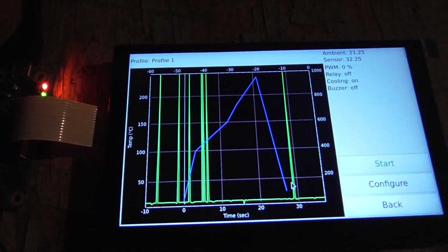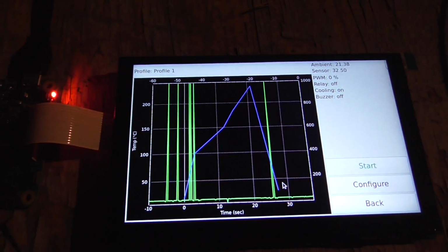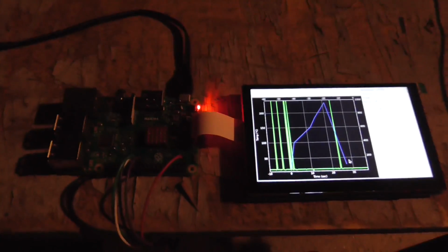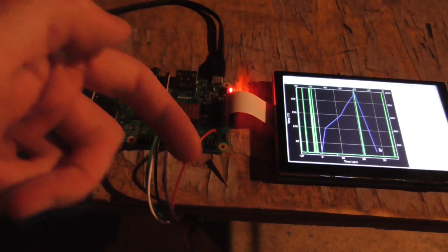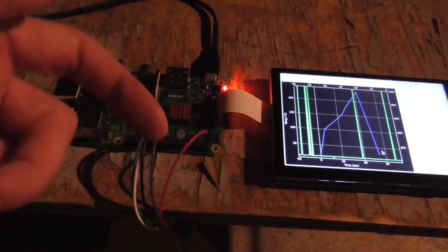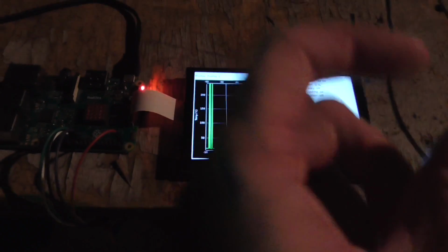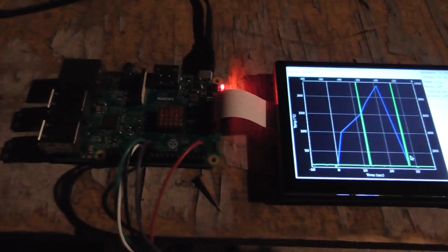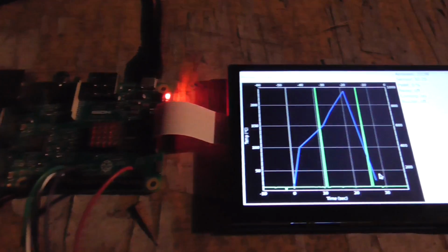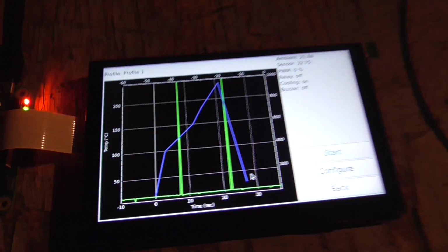And I was experimenting indoors, like at my desk with this. I wasn't getting any faults there at all, and what I discovered is that the reason I was not getting faults there is because I had my logic analyzer connected to some of the other pins where I was checking what the PWM output was doing, and the logic analyzer was connected to the computer, which is connected to ground. I'm assuming it's something like that. So for whatever reason, we're getting these faults now, which is really annoying.